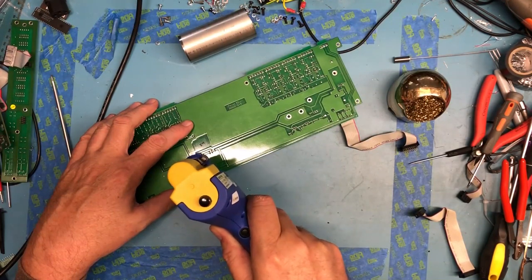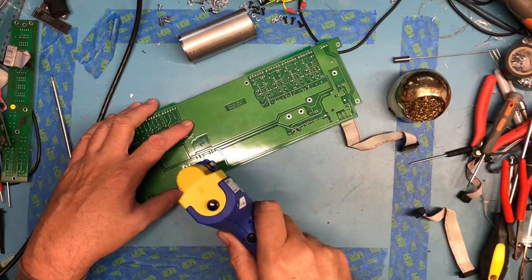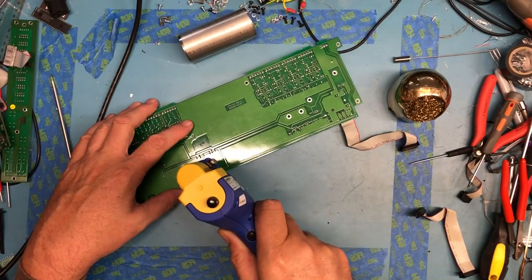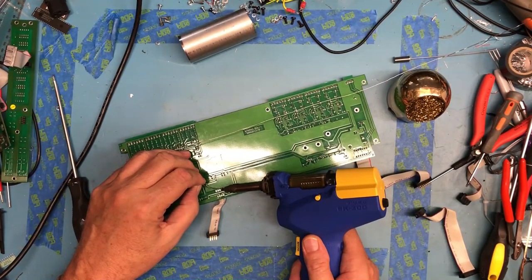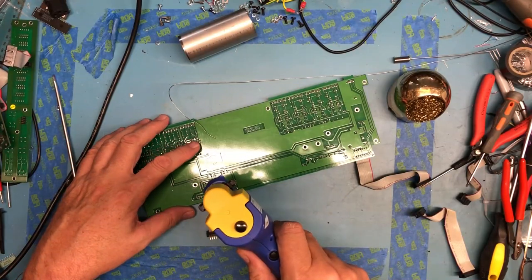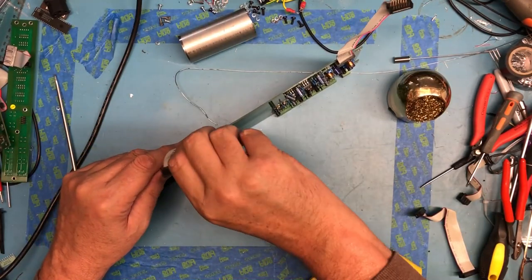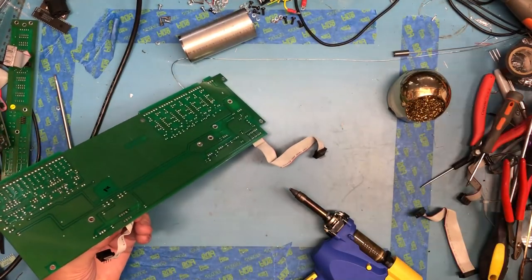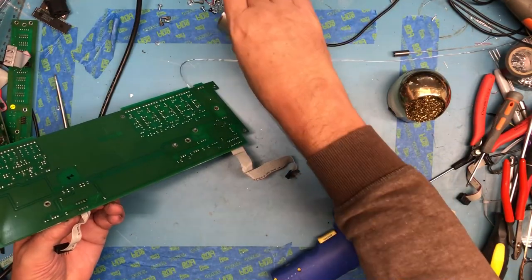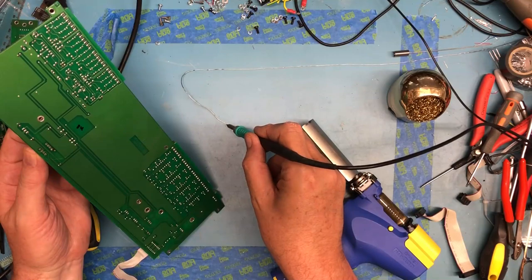We'll see if I can actually desolder anything. Pins didn't release as well as I would have liked. So we'll just put some fresh solder back down. Looks to me like they're probably both power bus. Are you loose? I think all but one pin is. We need to buy a stand for the soldering station. Come on, heat up. There you go.